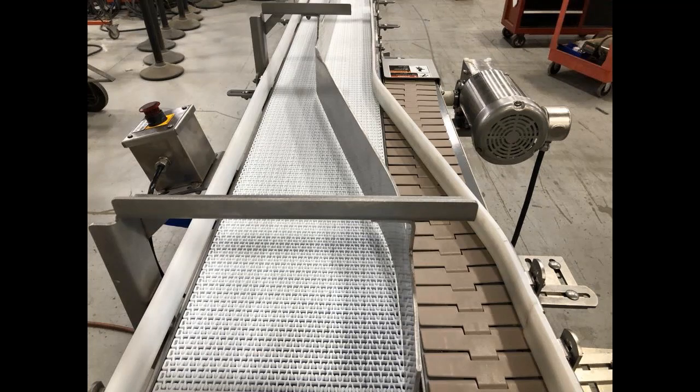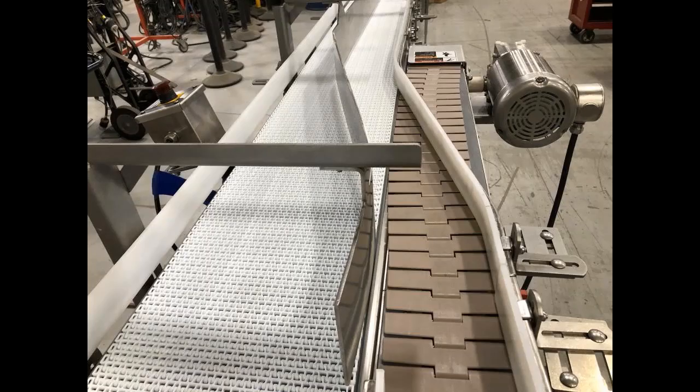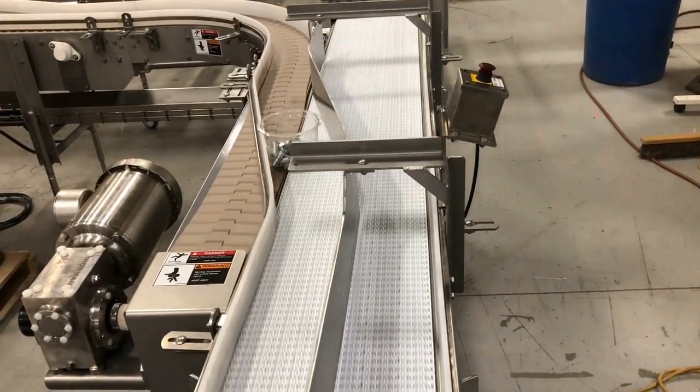The transfer area incorporates a chain drift design as shown here. Chain drift is a special option used to help minimize the distance between carrier surfaces that are supported by separate conveyor frames, requiring seamless parallel transition. Due to the smaller size container base, the chain drift also provides successful transfer assistance while maintaining both required orientation and required product rates.